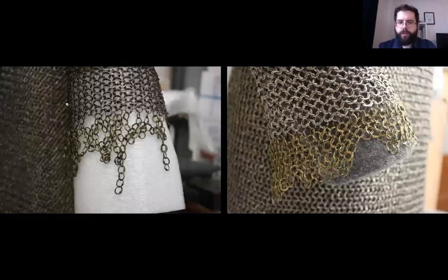The question is, why would we conserve a mail shirt? The interlocking rings of mail create a mutually supportive fabric that spreads the weight of the garment across the rings. When a ring is broken, the weight of the garment is no longer evenly distributed, putting adjacent rings at risk of breaking as well. It's common to find bent or broken rings around a loss. In addition to the structural concerns, the curators felt that the shirt was not displayable in its current condition. The minor losses would distract the viewer and the large loss around the neck would affect the overall hang of the garment. The insertion of replacement rings spreads the weight of the garment out evenly, reducing the strain on the surviving rings, and the replacement rings also pull the garment back to the proper position. You can see here in these before and after images of the cuff of a 15th century German shirt how the addition of just a few rings can radically improve the appearance and readability of a piece. Here in red you can see where rings were added to fill out the cuff.